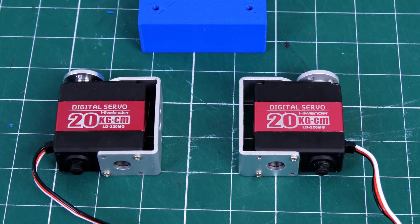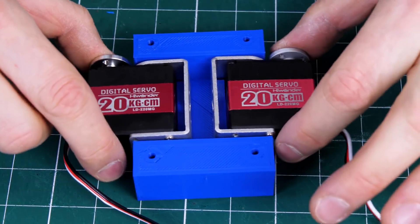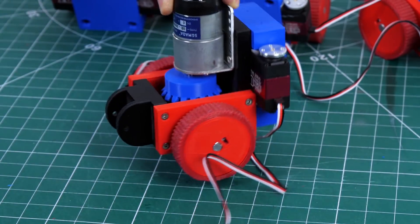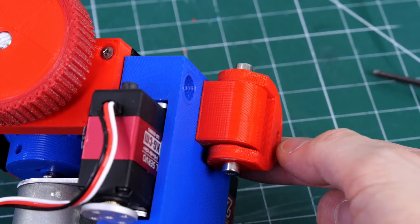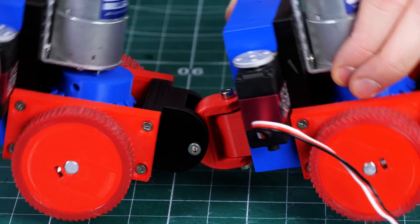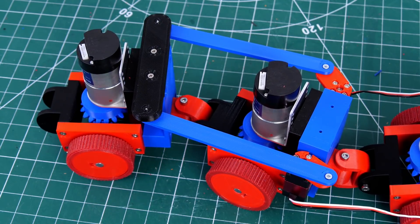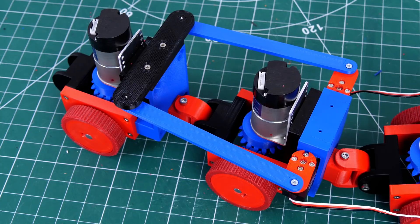To get two axes of flexibility I'm using two servos, both clamped on with the brackets they're provided with onto the back of each unit. The servo horns are at the top and they operate some levers which push and pull each section to make it bend. I made these bendy universal joint things — there's one on the back of each unit and a corresponding joint on the front, and four of these units are going to be linked together. Each servo has a 3D printed servo horn and a long lever that goes onto the next section.